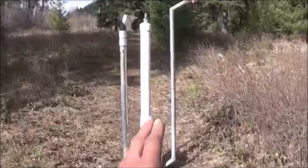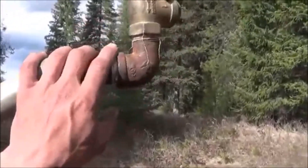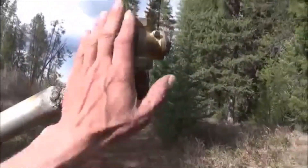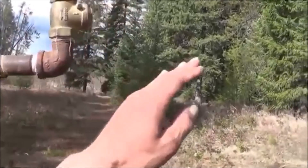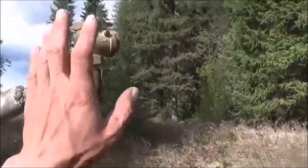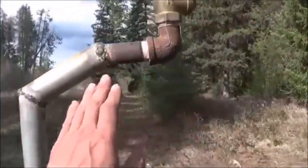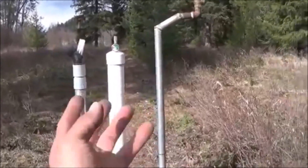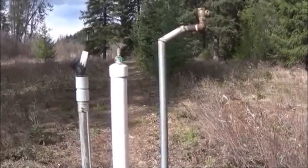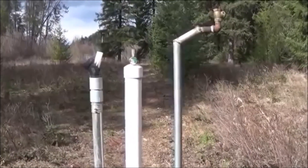Once the water ram opens back up, the pressure will be lower, and if you were able to build higher pressure in here than through the system itself, each time some of that pressure could blow water out and lose its gains. One of the added things at the end of this that we're going to do, once I get a couple more of these one-way valves, is up here at the top I'm going to extend this out and put a full water ram right here. So we'll have another one of these tanks sitting off of a T right here going up, we'll put our water output here, extend to another one-way valve just like the water ram video. That way we can get both compressed air and pumped water out of this system. Right now, I just wanted to check out how much pressure I can generate with the water ram effect incorporated into the Tromp design.